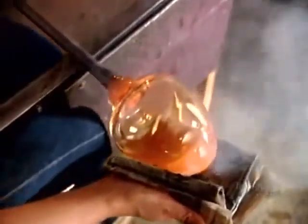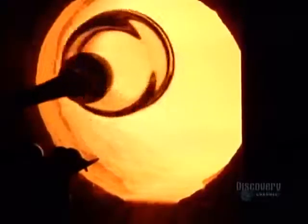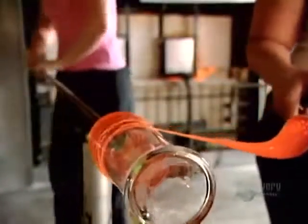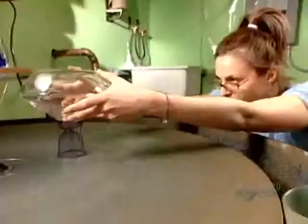More blowing, more shaping. Then, while her co-worker blows air to further expand the glass and thin it out, she cools the vase's bottom with wet newspapers to hold the cutoff point at the top. After reheating the glass to re-soften it, they stretch it, lengthening the vase. Once they finalize the shape, they use a wooden paddle to flatten the base. For decoration, vivid colored glass is coiled like taffy over the entire vase. Certain designs require cutting off a portion of the finished piece, leaving a rough, opaque edge they must extensively grind and polish.